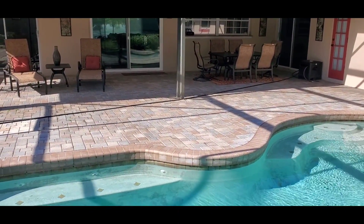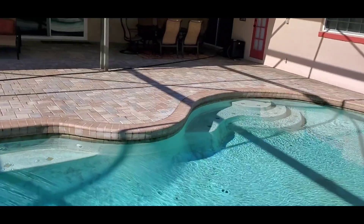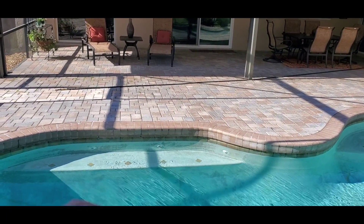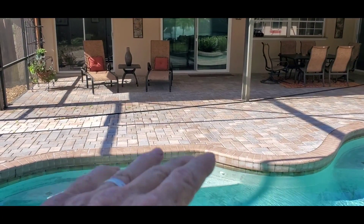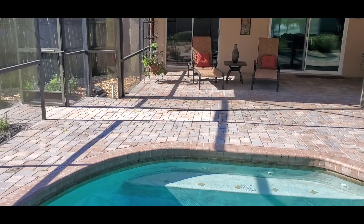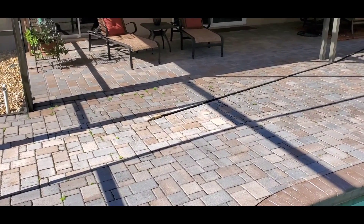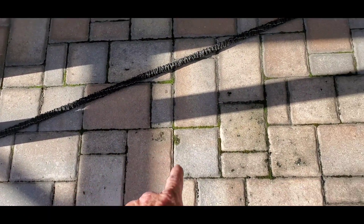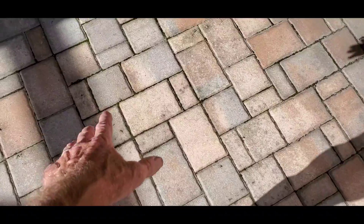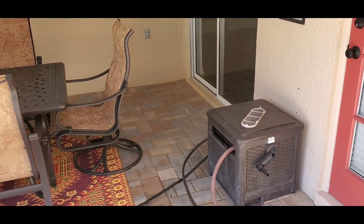You can really see it from this angle. The lanai is quite old. They have a beautiful pool — it's actually salt water. But that water runs across the pavers, and when it rains hard, it's just flooding right up and coming right up to the bottom of those sliding glass doors. Why? Because there's pavers across the channel drain — it doesn't allow that water to escape fast enough. Yes, it's graded this direction, but over a period of time this has sunk. So now we have low spots here and here, and you can see the algae is growing all through here. The same thing occurs here — you can see it's all wet, the algae water sits here, and when it rains hard, that water is just running right back up, almost coming into the home.